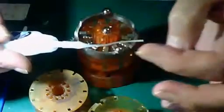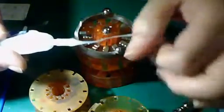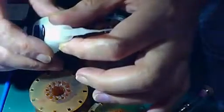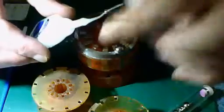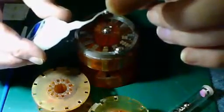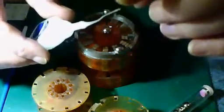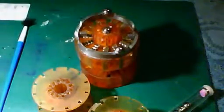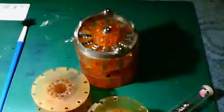And I'm also concerned about this stupid super glue thing, because I'm going to have to use this very fine nozzle so I don't get too much glue out, and this thing has a habit of clogging up because it's so tiny. Anyway, I've been through a few of these. I've had to keep trimming the ends off, because this is a new one actually. Once they clog up on the end, it just gets impossible, because you poke them out with a piece of wire. The contaminants of the wire make the super glue stick even more, and it's a cascade effect, and then you just can't seem to get the damn thing unclogged once it starts to clog, and it's really annoying.